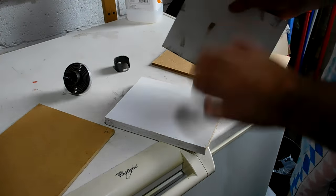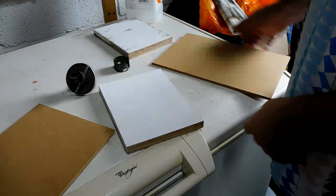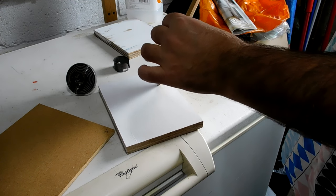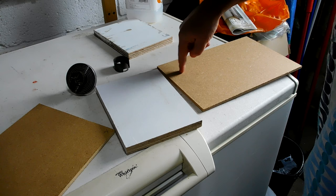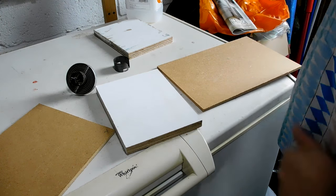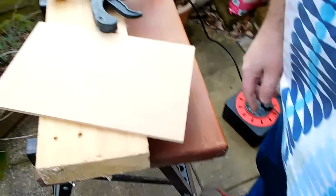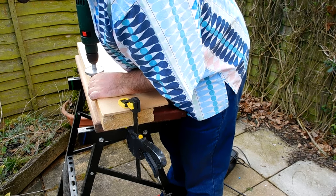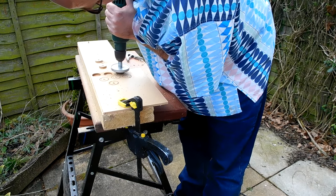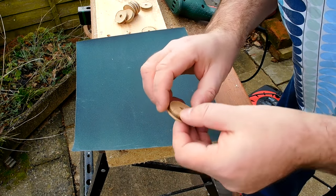My forging mould for this plastic is going to be made of two nice thick bits of scrap ply which will provide the spreading force, and an inner layer of MDF which is about 6mm. So I need to cut some little circles out of this first and then it'll all make sense in a minute when I start putting it together. I'm going to give these pieces a little bit of sand to take those woolly edges off, just tidy them up a little bit.